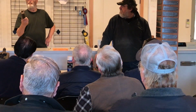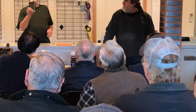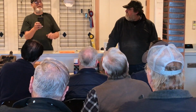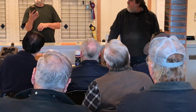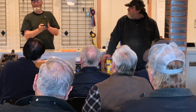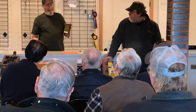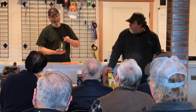You look at this can, it's an old can, but it has this screw-on metal lid. If you see these cans, brake fluid cans are another item. That's the perfect cap and part to put on a gas tank when you're building gas tanks. Very hard to find when you want one, so if you see an old can like that, especially at a swap meet for a couple bucks, there's your cap and your spout for building your next fuel tank. Like I said, you can never find one when you want one, so you gotta grab them when you see them.